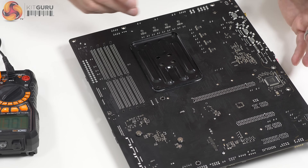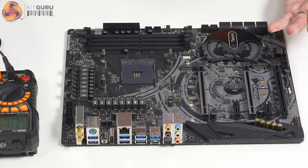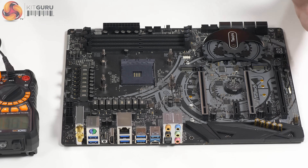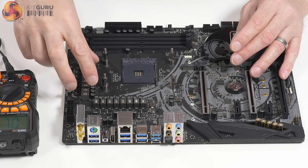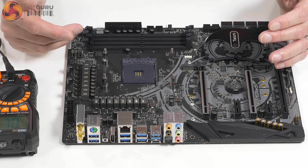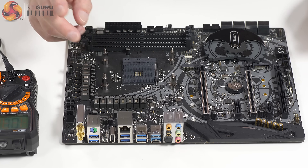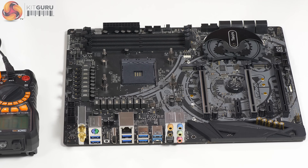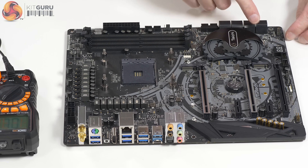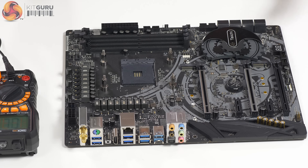A repeat of what I found on the front, which suggests the 16 are working in unison. I don't get that — that makes no sense to me. I don't see any other SOC hardware, so if you have any views on the VRM arrangement, feel free to leave a comment below. We've also got the 12K Japanese Nichicon caps — that's lovely, and one of the features ASRock refers to, as cosmetically they look good and aid longevity.